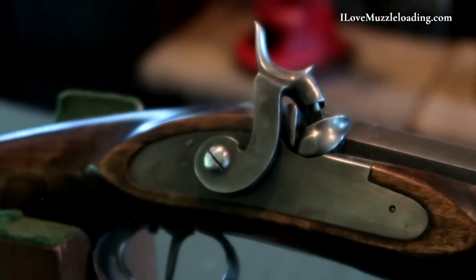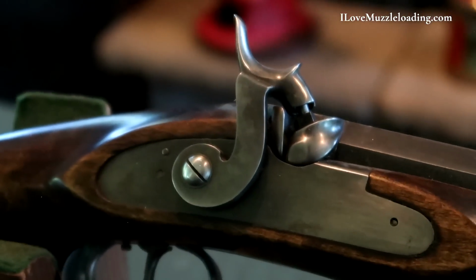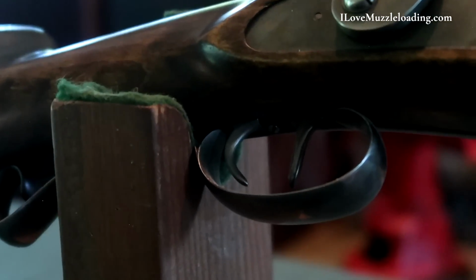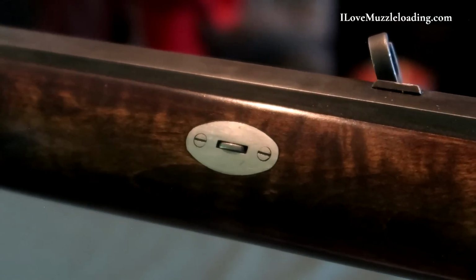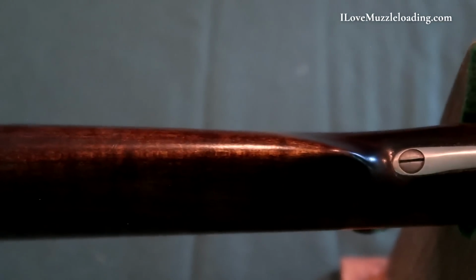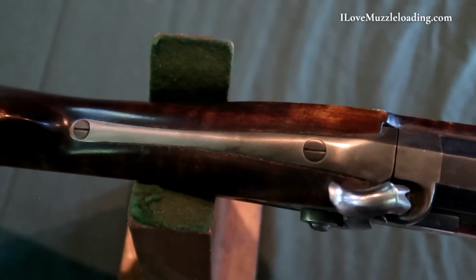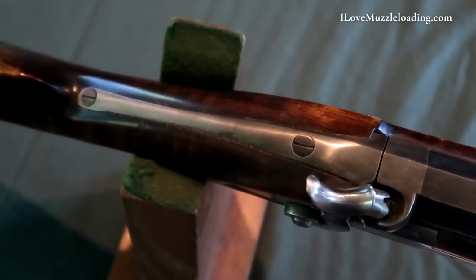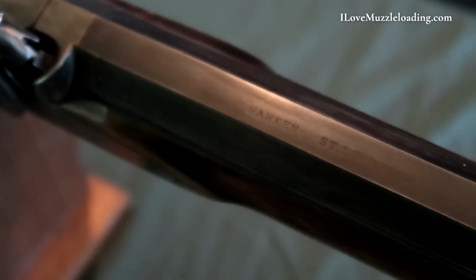It weighs about 11 pounds with a 34-inch barrel. I have color hardened the breech and the tang so they look like they're case colored. They were actually forge hardened, original ones, and they had a mottled gray color. They did not have the blues and reds that Turnbull shows on his products. But they're very plain, and I brush them off with 4/0 steel wool. The tang, breech, lock, hammer, butt plate, toe plate, and trigger plate should be hardened, or at least show a hardened color to be authentic.